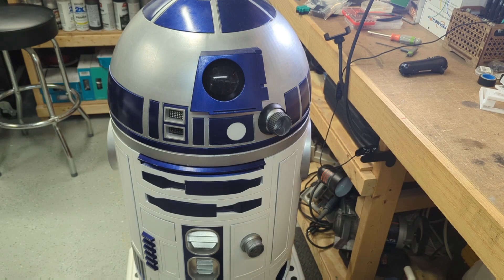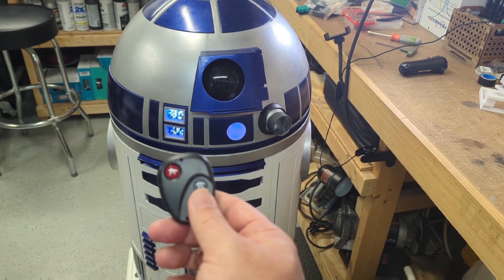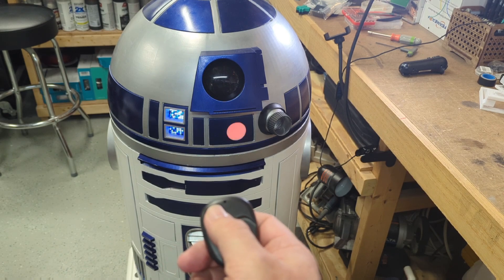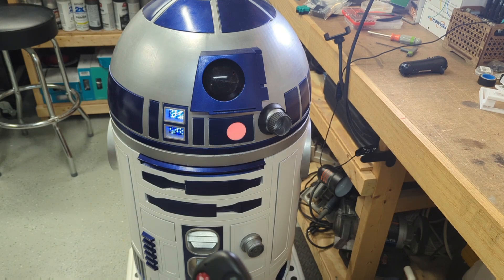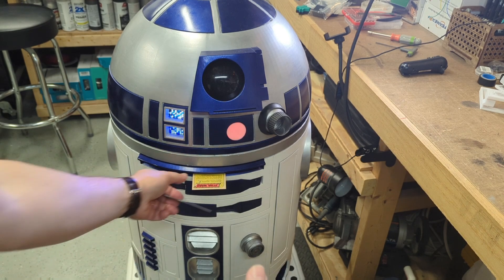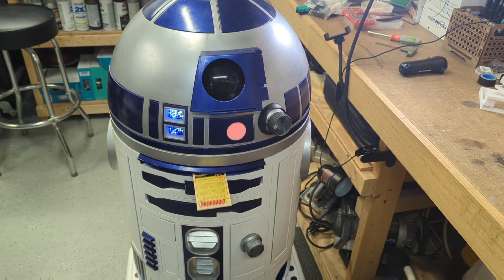All right, let's see what happens here. As I mentioned, I'm using a separate remote relay to power this, so I'm not directly integrating it with my control system. If you're running Shadow or Padawan and you have access to your Arduino, there are plenty of ways to trigger a switch. James's initial implementation used a servo-controlled switch along with a timer circuit to control the timing. For me, if I just press and hold the A button, the card dispenses — I can press and hold it as long as I want, and it seems to be working pretty well. You can just keep going if he wants to be really generous and make all the kids happy.